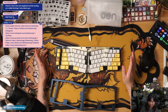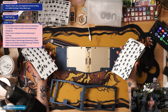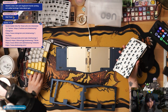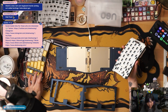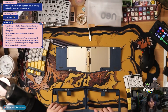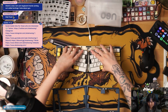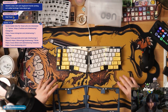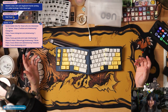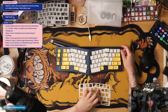You have a couple different anchor points to make sure that you're fully aligned correctly. And then taking it apart is as easy as pulling this off. This is the indicator diffuser. This is installed on top like this. This is where the diffuser for the LED goes. So once you have your switches and everything assembled, just snap it on, make sure that it's aligned and not moving. Take this top piece and you just pop it on. Done. So simple.